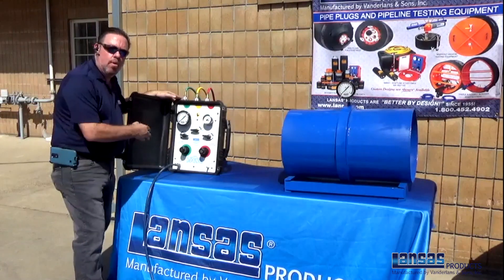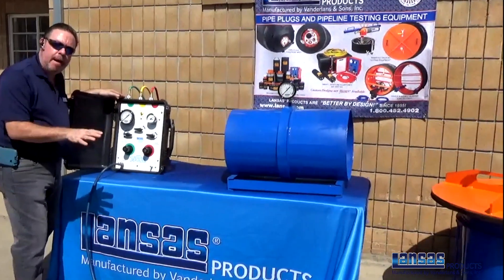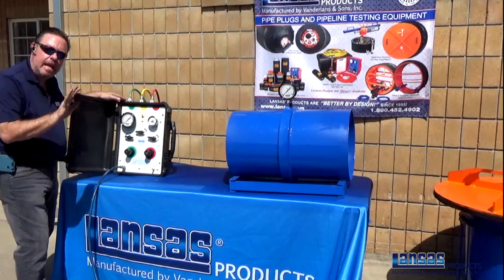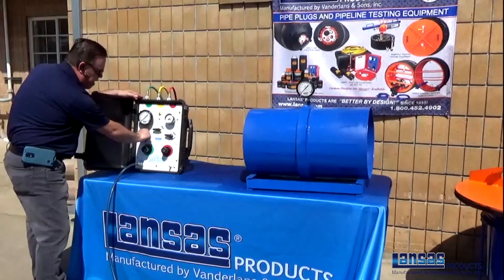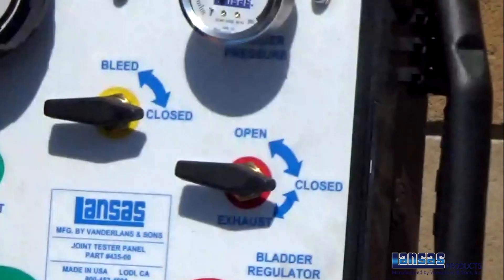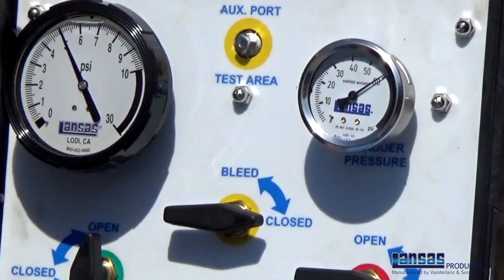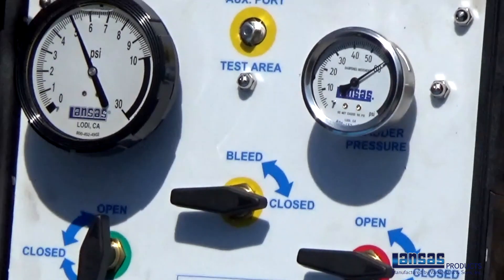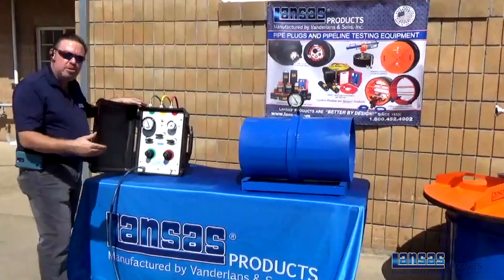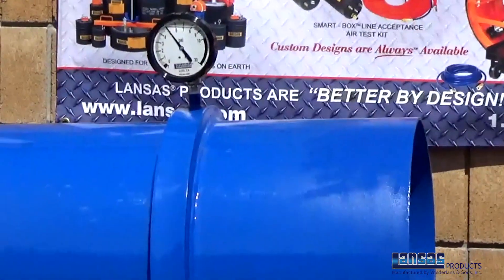Now that we've got our air source going to the actual joint test side, realizing we're in concrete pipe and by your ASTM standard, that's normally a five-psi test at five seconds. So now we'll open our valve and gently start to work your regulator up to get your pressure on the joint itself. Lock down your regulator. Close your valve. Most inspectors at this point would want to see the time to start. We are showing pressure not only on our panel but actually pressure to the joint itself.